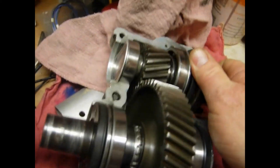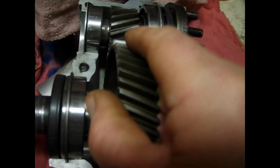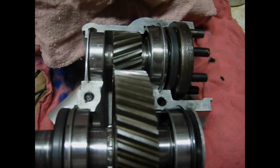What we're going to do is look down in here where these two gears come together, and as we turn them we've got to have an air space inside all the way around, so we know it's not getting tighter in one spot during rotation than another. We go all the way around in a full rotation and we've got an even gap all the way — no wobble to the gear, no slop in the gear anymore. It's a very nice tight fit. Looks like we're ready to put the box back together and see how she flies.